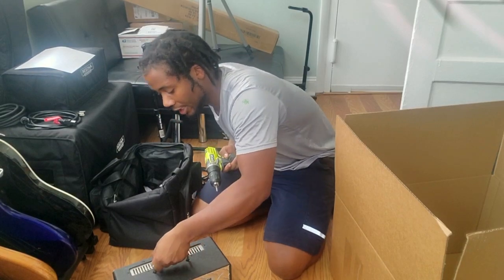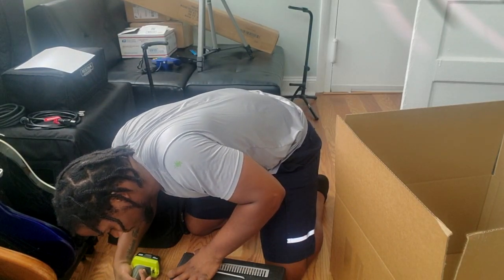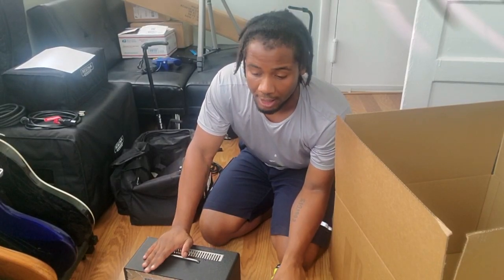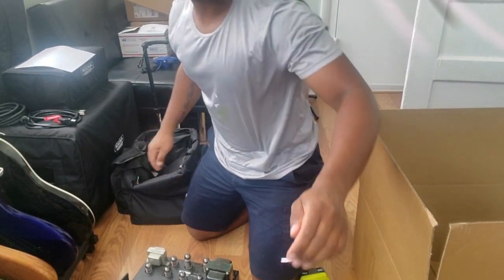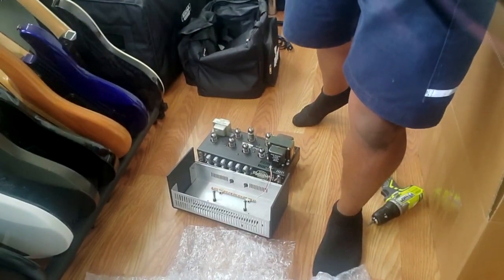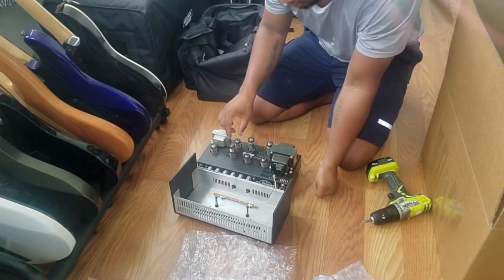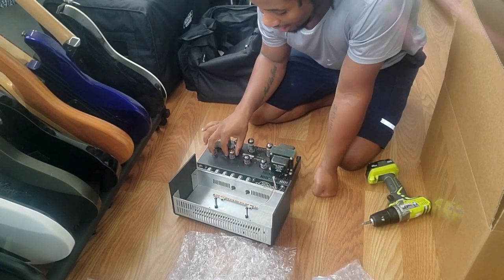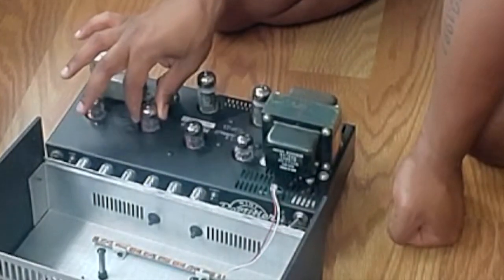For this particular amp it's really easy to take the cap off the cover — you just use a drill. You also don't want to do this if your amp was on for a little bit. You want to make sure the tubes are not hot, because they're more fragile when they're warm. Cap should come right off. And as you can see, you can see the tubes right there. Now if you've never taken tubes out of your amplifier or replaced tubes, it's actually really simple. You're going to use a rocking motion. Grab the tube with a firm but gentle grip — you don't want to squeeze the tube. Rock it around in a circle and gently pull it up and you'll feel it coming out.